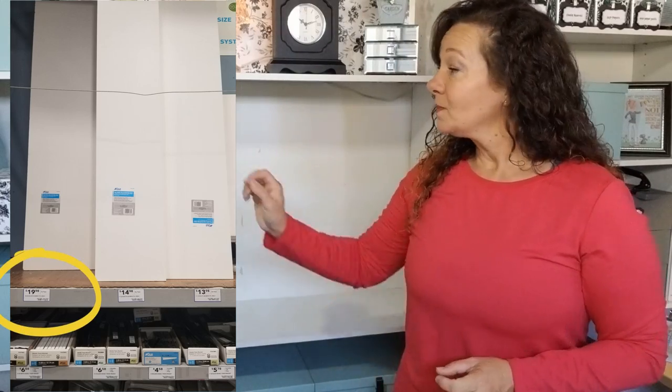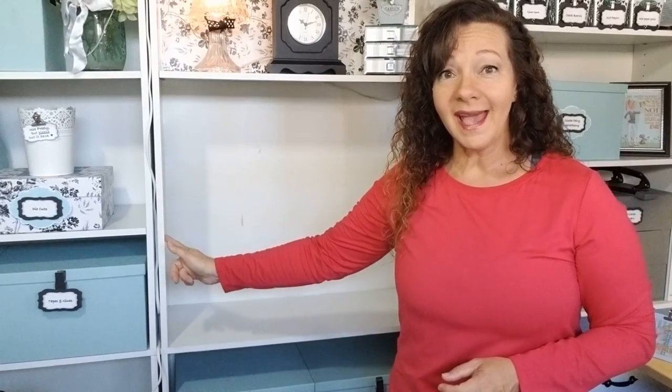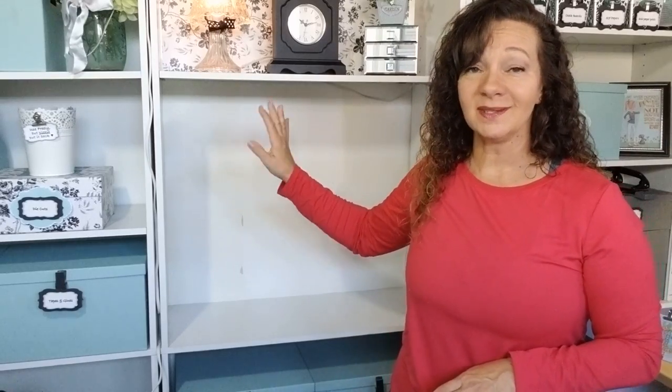If your cabinet already has the holes, just take out one of your existing shelves and take it with you — it won't get any easier. The melamine already comes bullnosed at the ends and is already white, and sometimes the store will cut it for you at no extra charge. This is something I do for my clients so often — for twenty dollars we can add storage that matches just by adding pegs. But if you don't have pegs, this is what we do.